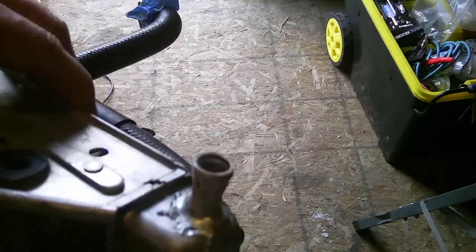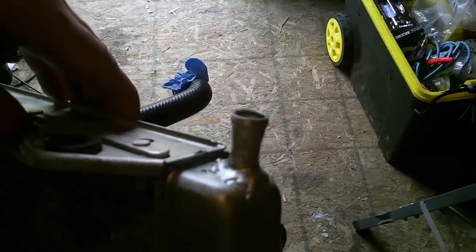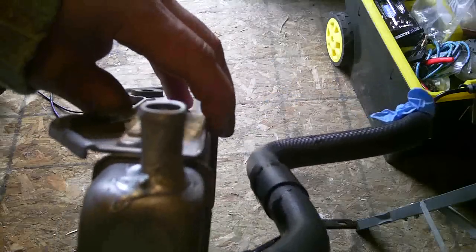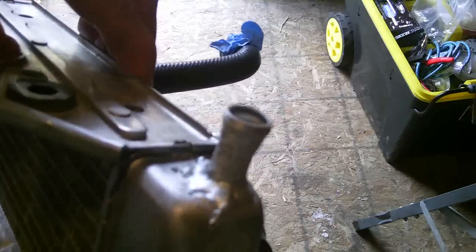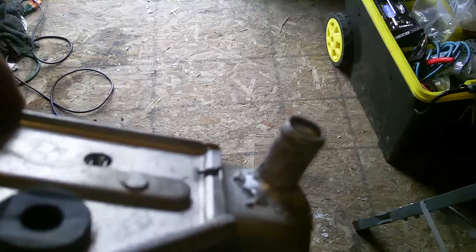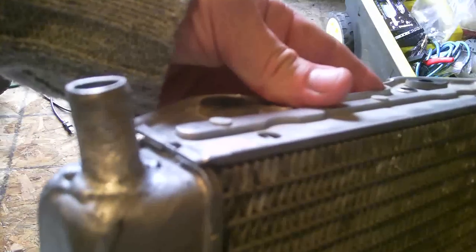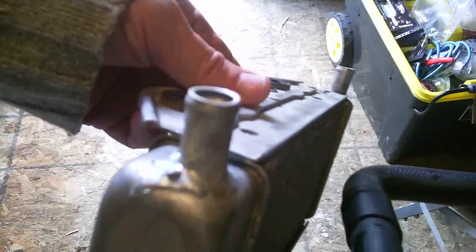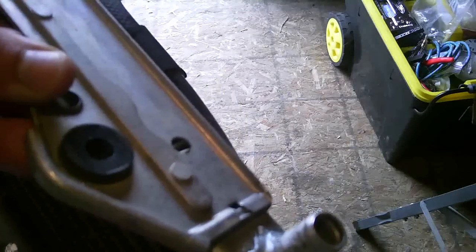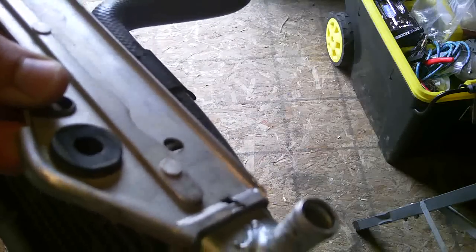Okay. My first weld didn't go so well. It was leaking. So I applied more heat to the aluminum since it's way thicker than the cans that I used, and basically just redid it. And here's the pretty result. I've tested it up to 35 pounds of PSI and there's no leaking. So seeing as the maximum pressure designed for the system is 18, I'm pretty well sure it's going to last.